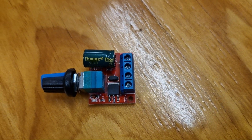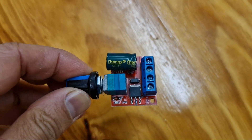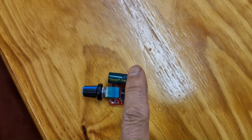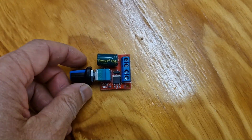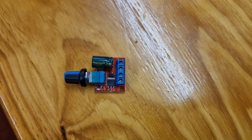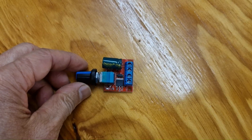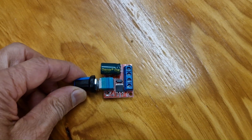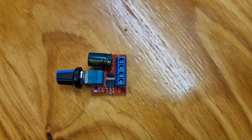Just a quick word about controlling the rotary spark gap motor speed. You can get pulse width modulated units on eBay very cheaply to control your motor speed. You can use some sort of power pack with the correct current rating and then just two wires out to the motor, wired close to your main control switches for the transformers. Run a low voltage cable to the motor. I'm not going to go into too much detail, because I'm assuming that if you're going to undertake this sort of project you understand some of these concepts.